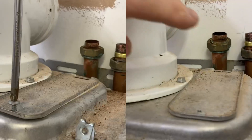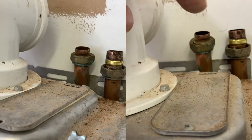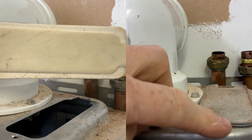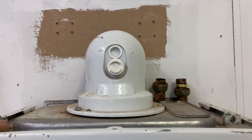Unlike all the others which have been combi boilers, this is a heat-only boiler. You can see the flow and return pipes which would go off to feed the cylinder as well as the central heating. The cover is held in with three screws, and another screw around the side which is a pain to get to when you're fluing straight out the back. When servicing this boiler you must make sure you do a sweep test around these seals — we'll explain that later.